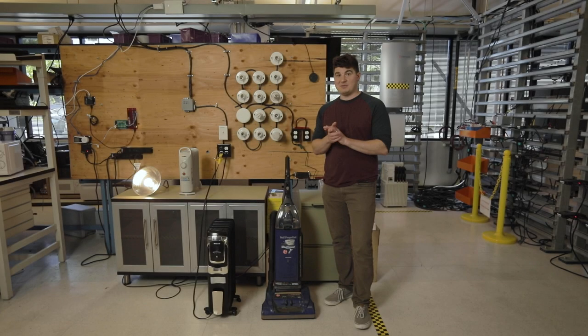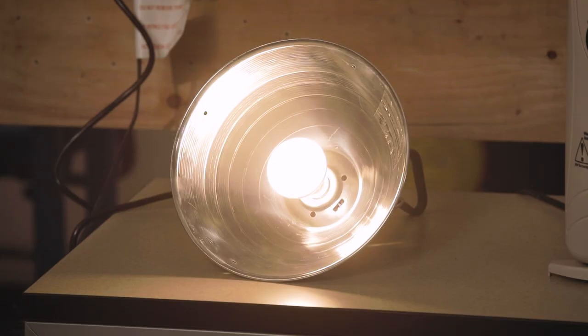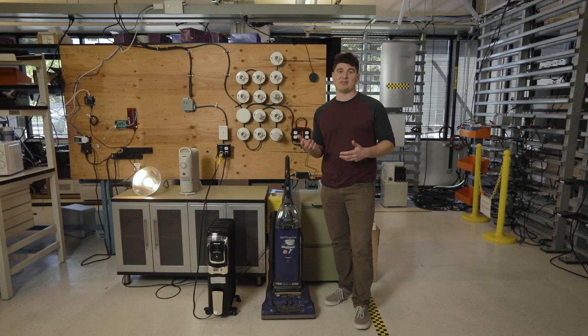All right, so we're gonna do one more demonstration of brownout control, this time a dynamic demonstration, where we're gonna show what happens when you have good sunlight, but then some clouds come over and basically temporarily reduces the amount of sunlight that you have and thus power feeding your system, and then that cloud cover goes away. So we're gonna show the dynamic performance of intelligent brownout control and showing how it can respond very quickly to changing conditions.